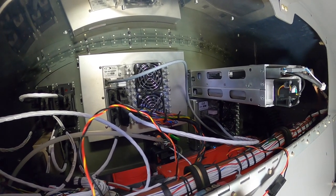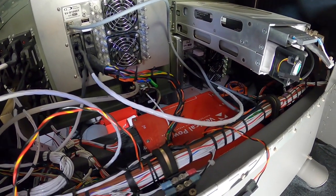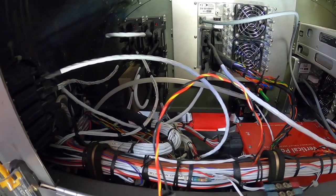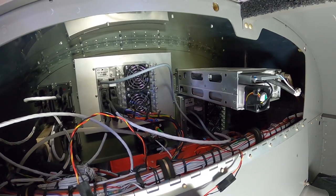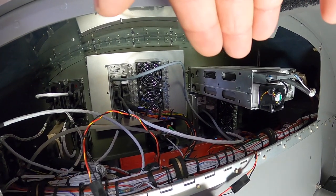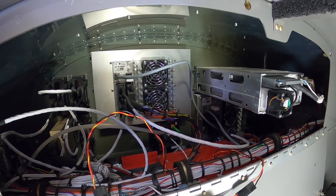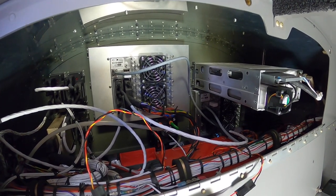This panel just gives you a lot more access — an area for your hands to get into to get to your wiring. The red box there is my Vertical Power, that's the solid-state circuit breaker technology, and then you can see all my wiring here is wire-laced. Some of this extra wire I just coiled and laced up. The other nice thing is when you take the 10-inch screen and the 7-inch screen out from the cockpit, you have a big open space too, so one person can be up in the cockpit and the other one can be here — you have a lot of access to get your hands in to do some work, change things, modify as needed.